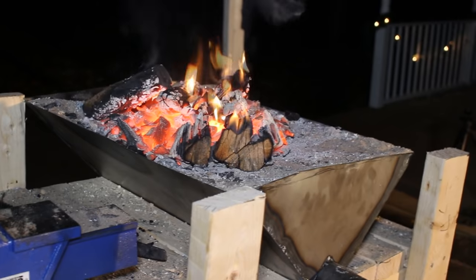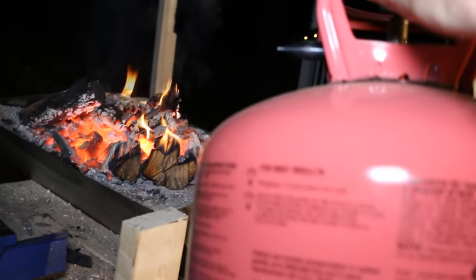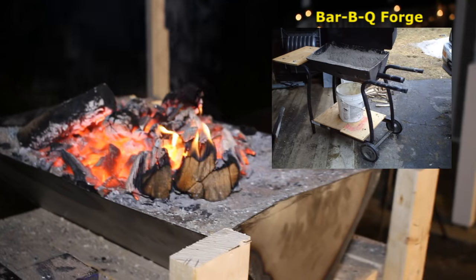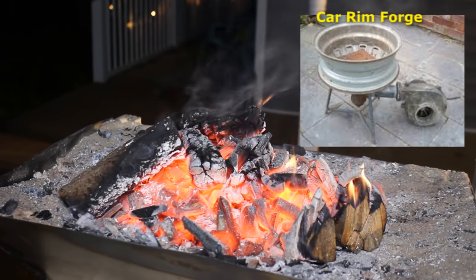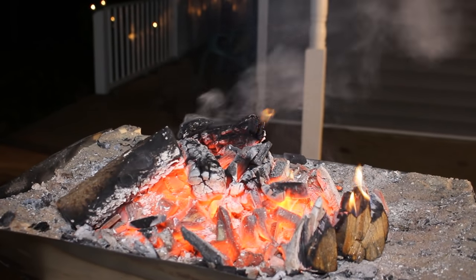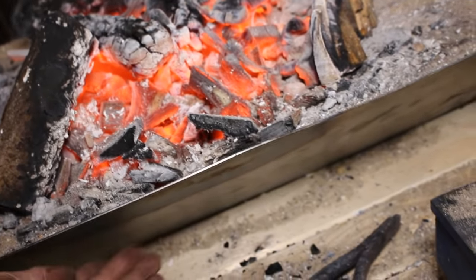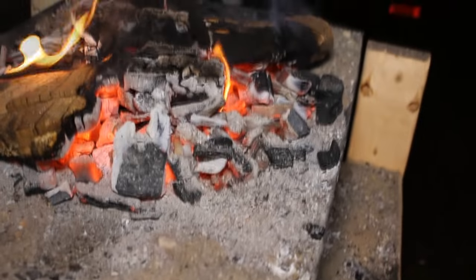The great thing about these wood-burning forges is you can use just about anything to make them. I used sheet steel, but you could use a helium canister cut in two, a barbecue shell, or even a metal trash can — just about anything will work if you insulate it well enough. Sand is a fabulous insulator, and as long as you have a good layer of sand on top of the steel and the fire rides high up, there's almost zero heat transferred down and the metal doesn't get heated up. Everything but the very rim is cold to the touch.